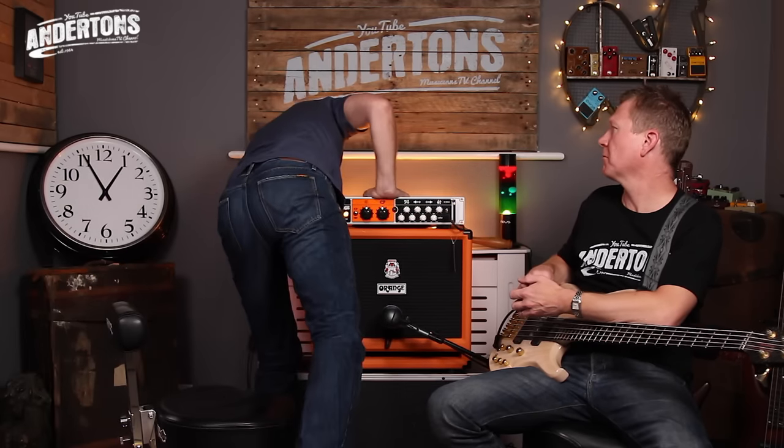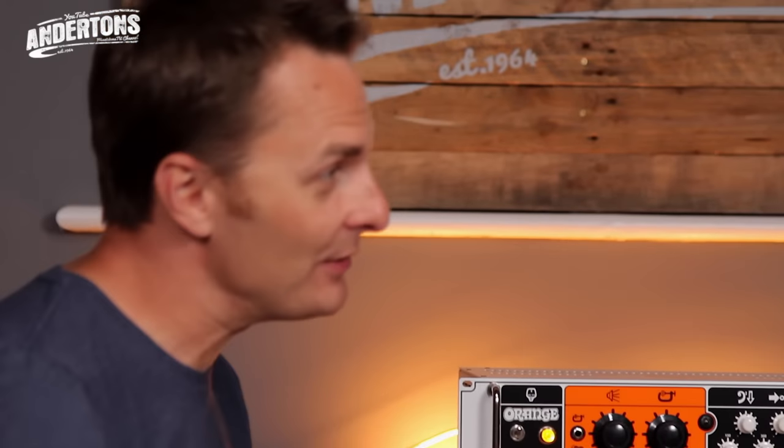Stuff on the back is very, very simple. You've got your speaker outputs, a balanced output, a line output — and that's it. Oh, and a fan — because of course Class AB is old-fashioned technology, not terribly efficient, so the amp gets hot. The fan is thermostatic, so it'll only come on when the amp reaches temperature. The hotter the amplifier gets, the more power is lost to heat rather than being transferred into the speaker — so if you can keep the amp cool, more power is delivered to the speaker and it sounds louder.